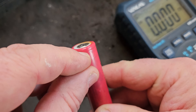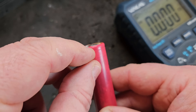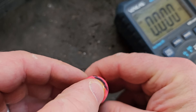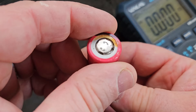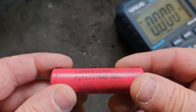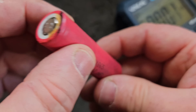It's like a gas release — I think it's due to temperature — and it pushes a connector away from another connector in here, rendering this side dead. It's not connecting through the cell. That's a safety feature. To disable that is really, really irresponsible if you're going to use it in a pack, because you could risk fiery death.